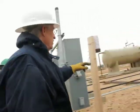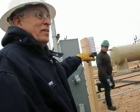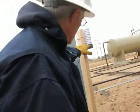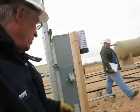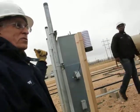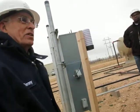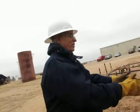Tell you one other thing we're doing with OTC. This is a field test of an explosive limit detector. We tested several of these earlier, and then they wanted to put a model out, see how well it held up in the weather. That Jake-legged looking thing is just a field test of how well this is holding up. It's transmitting signals back into a Wi-Fi system that we can pick up. We'll shoot it every now and then with some methane, see if it's still picking up gas. So that's a field test. Don't look for anything like this on a tank battery.